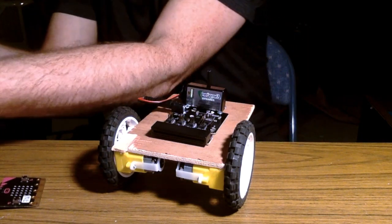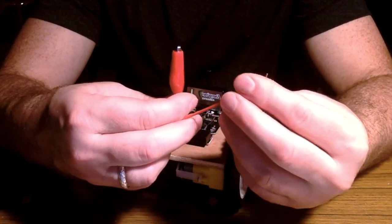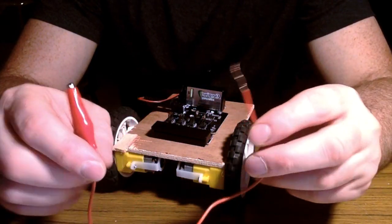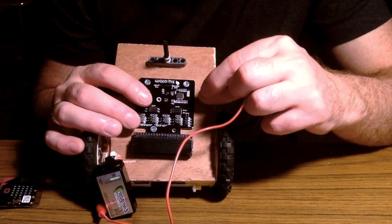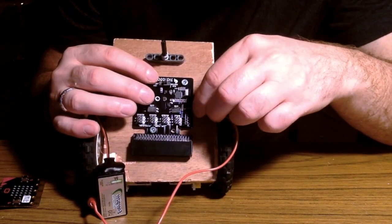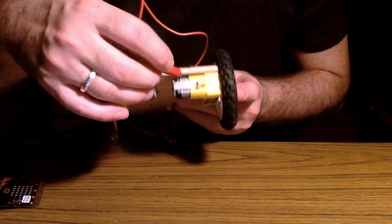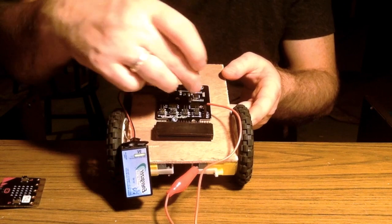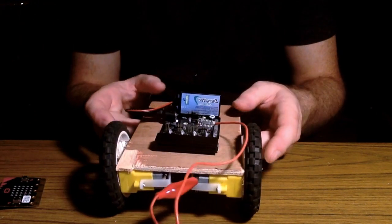For the motors and wiring them into the board, I took an alligator clip and cut the end off and stripped back the plastic. You can also get alligator clips with pigtail ends, which would work a lot better because in the Moto:bit there are two spots for your motors — a left motor and right motor. If you had a pigtail end it would work a bit better, but I can still slide this in and clip onto the terminal.